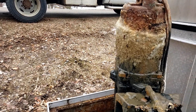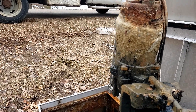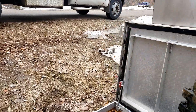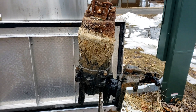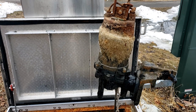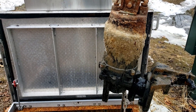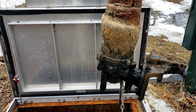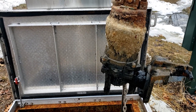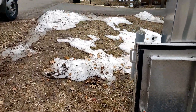Then the water can flow by gravity again. Every town in the United States — unless it's a really small town — generally has a gravity flow system. This is what our pump looks like. It's a very small three-horse Hydromatic. I can scrape all this fats, oil, and grease off of there — it's nothing icky — and we can put it right back down in there and get this lift station working.